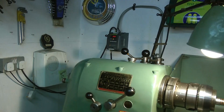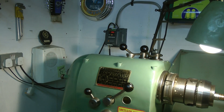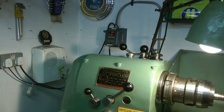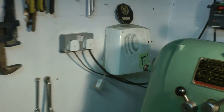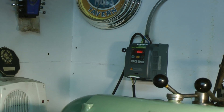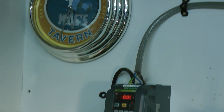The controls. Now, when I first bought my Colchester, unfortunately it came with a single-phase motor that when you plugged it in, it blew all the electrics. So that was no good at all. I had to scratch my head and, after a bit of reading up, realised that I needed a 3-phase motor. But I don't have 3-phase electricity, so I had to plug in one of these — a variable frequency drive. As you can see, the 240 goes in and it then exits to the motor, which is in the depths of the lathe.